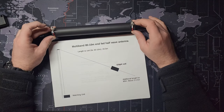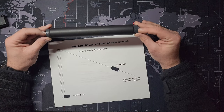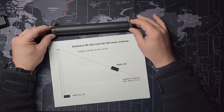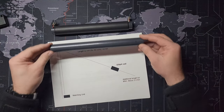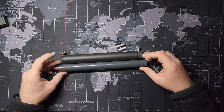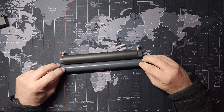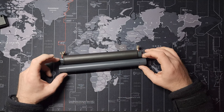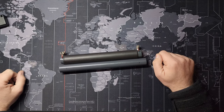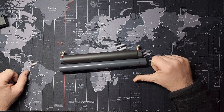I already have this one for myself, but I want to build another one for a friend as well as make a revised version so I can put that ring terminal connector in there. I already have it over on the side here - I measured it out a little longer as you can see. Now to figure out what you need for a loading coil, you have to use the coil inductance calculator. There's a real nice one online at 66pacific.com - I'll put that into the description.